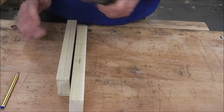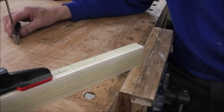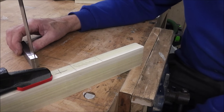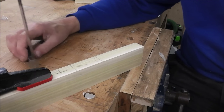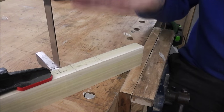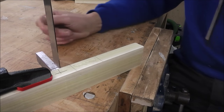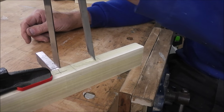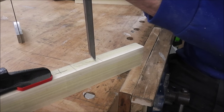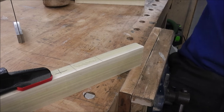I'm going to reposition the camera so we can see in more detail what's going on. I've put the mortise piece on the bench and clamped it on so I've got the mortise over a bench leg, which means it's nice and firm and stable for chopping down with a mortise chisel. I've also checked with a square that it's sitting vertically from the bench, because it's really critical that we're chopping with the mortise square on with this surface here. I'm sitting at this end of the piece so I can actually eye up to see whether my chisel is angled or not — if it's leaning over, then obviously the mortise will be leaning over and the tenon piece will be skewed. So I'm going to start chopping this mortise.